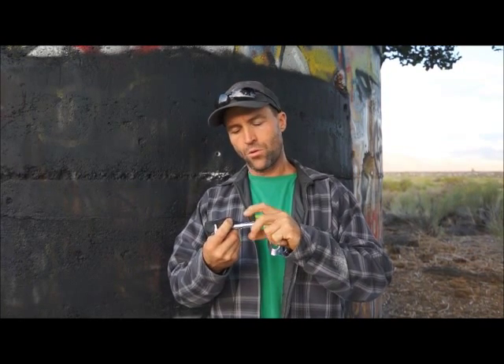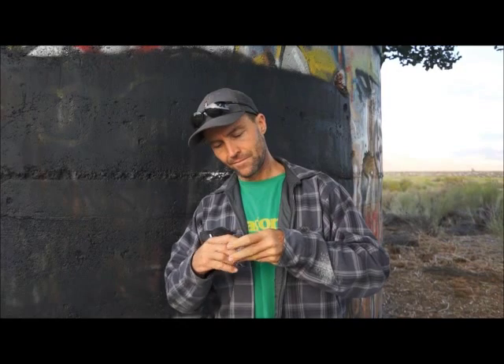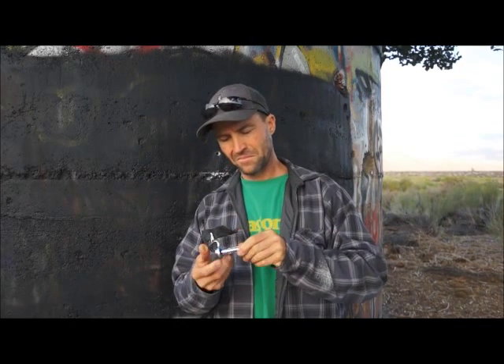We are going to have to disassemble this bolt to get it onto or through the hanger with the half-inch hole. When we reassemble it, it slides over the sleeve, which is what we want. The sleeve of this bolt — the split sleeve — is really where all of the expansion takes place. As we tighten this thing down, it draws the bolt out of the hole over this tapered cone and creates expansion. To get this started, we need to make sure that she's set in here about right.